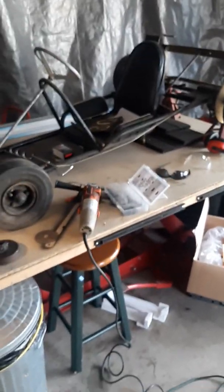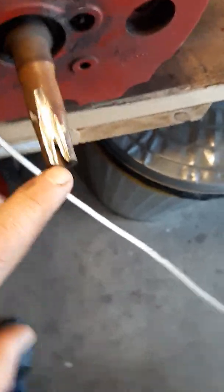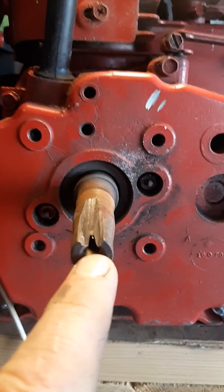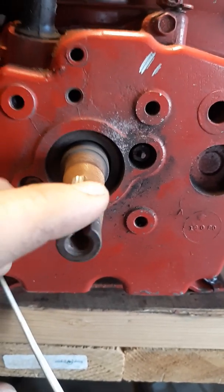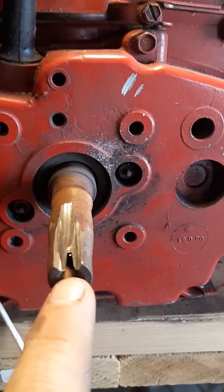Like I said, sometimes you make things harder than they have to be. Now, since I started grinding this shaft, I've decided to go ahead and fill-weld this back in. Down here it's actually got a hole that you're supposed to put a bolt in. I got into the threads when I started grinding, as you can see. So once I get this fill-welded back in, nice and smooth and level, I'll run a tap in here to re-tap these threads back to the way they were, because most of them are still in good shape. Re-tap them, then do the welding like I was talking about.